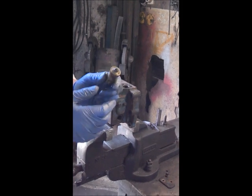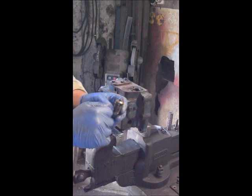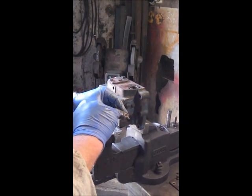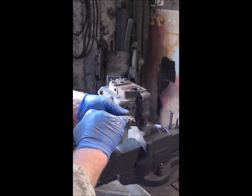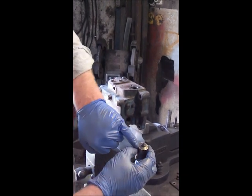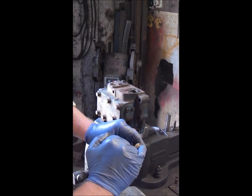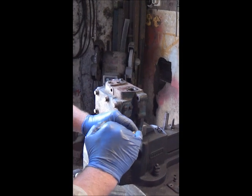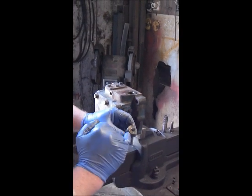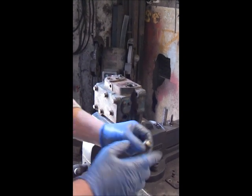This is the all-important part. The modification includes making holes or cuts down the side here — at the bottom, not at the top but at the bottom — so they go into this part of the face, not the cone. Don't get anywhere near the cone because otherwise you'll ruin the valve, as that's the bit that does the sealing.